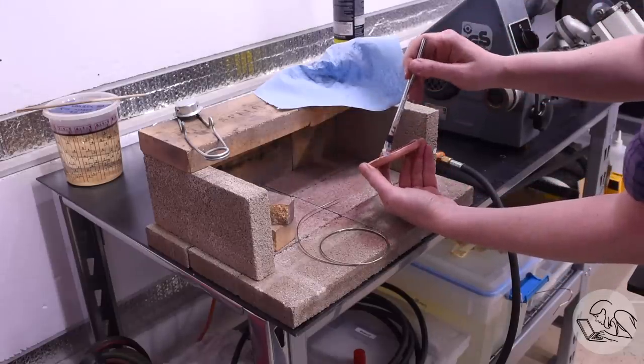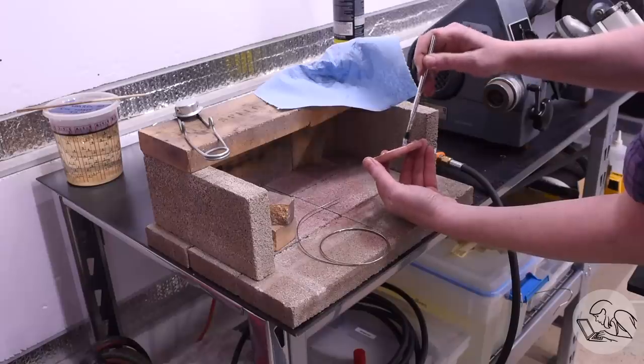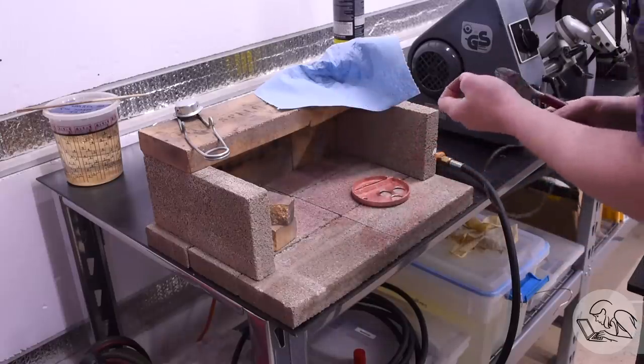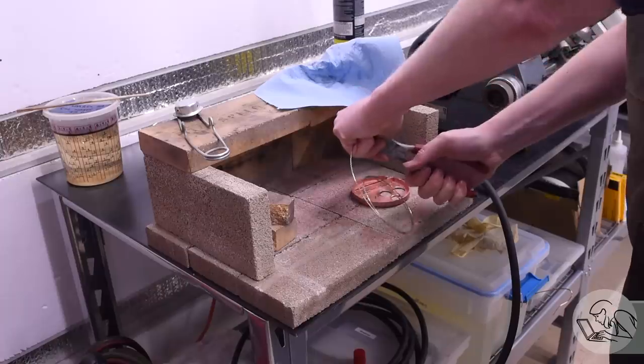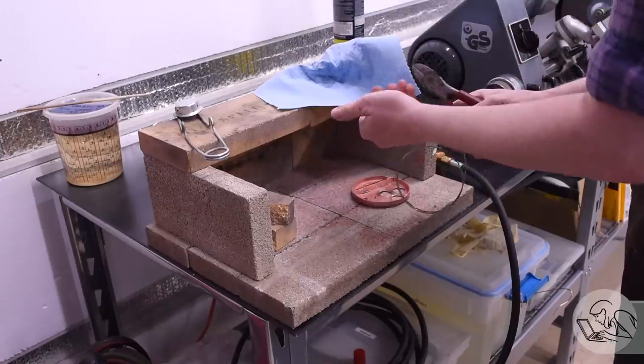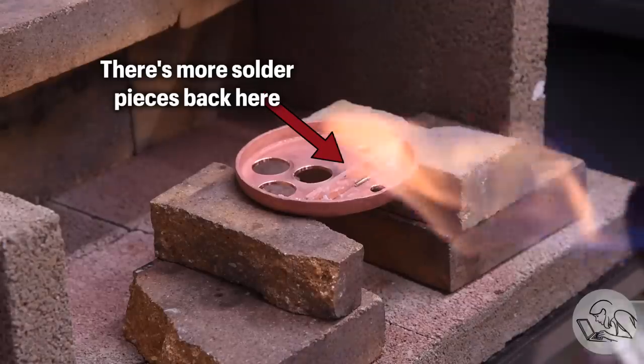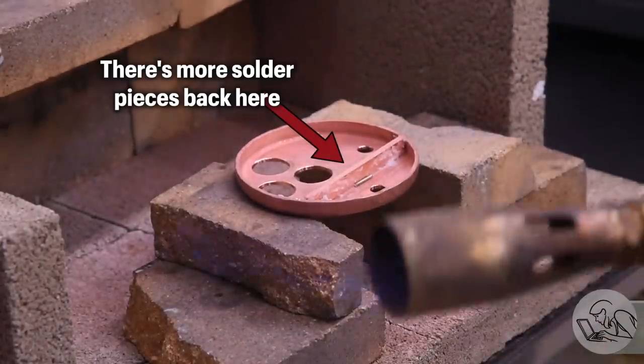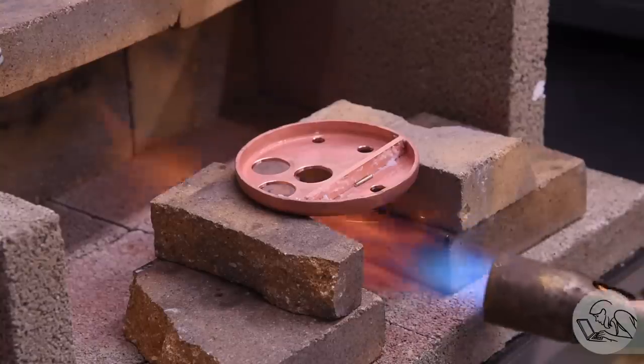The silver solder chases the heat. The flux, however, restricts where the silver solder can go because it won't stick to any surface that isn't chemically clean. Next, I cut and place little pieces of silver solder along the joint. This is the by-the-book Kozo silver soldering method, incidentally, and I found it to work extremely well, much better than any other technique I've seen.